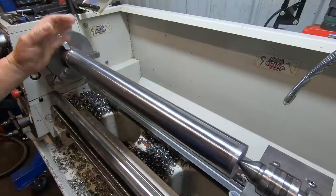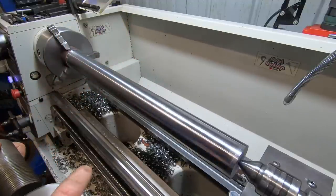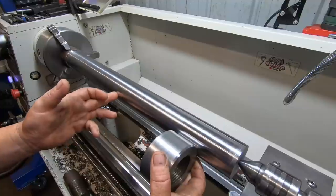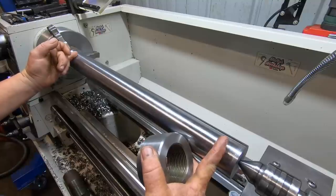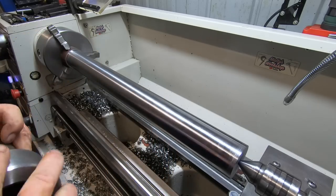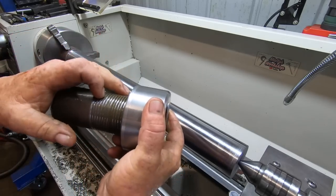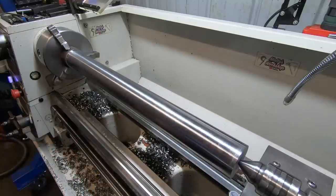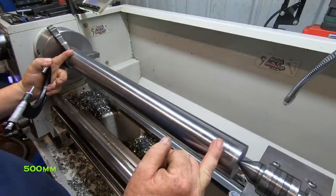What is going to be — if I can make it happen — is the threaded bar for the adjustment on the faceplate table. Off camera yesterday I stuffed around and made a nut. There's going to be two of these, 200mm apart with a spacer in between, and 500mm of thread. So you're going to have 300mm of height adjustment. I made up a thread yesterday so I can check myself, because it's an 8 TPI thread — I can't go any coarser with the inserts I have. I would have loved a 4 TPI thread but the inserts I've got, for both internal and external, don't allow me to do a 4. Over the whole length I've got one thou discrepancy.